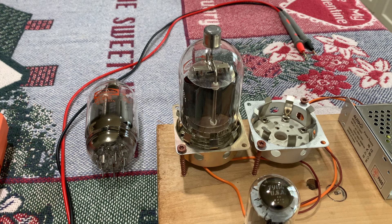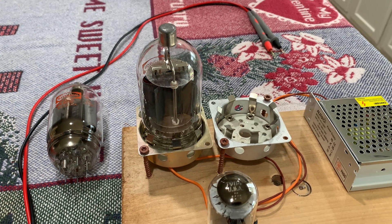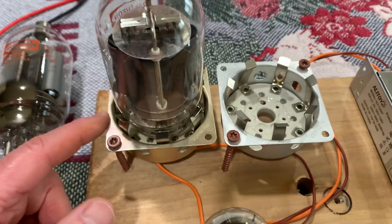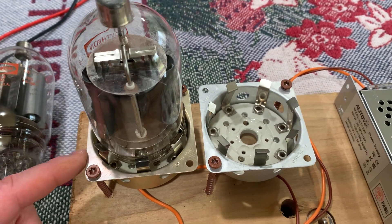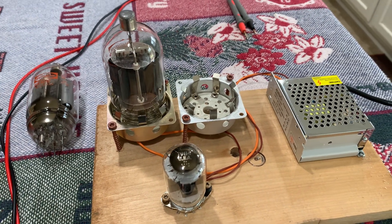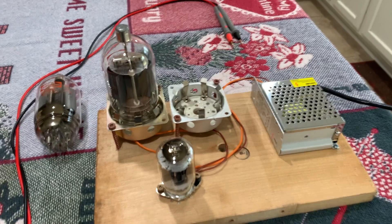So that's the story on this. I should be able to build this amp to where I get about 125 watts carrier out, and then full modulation on the peak envelope power, which should really help me out on 10 meters. I already have the tubes. I had to order one socket — I only had one of these old Johnson sockets and the one I had was the original from the fifties, a bit different color than the newer production one, but they're both the same Johnson part number. This project is easy — I already have the plate transformer and I'm going to pull it out of another old chicken band linear. Once I finally get the right supply and get it powering up the 4D32 filaments, we'll make another video. 73, this is W5HRO.